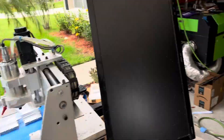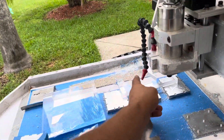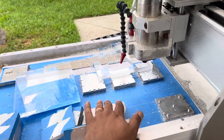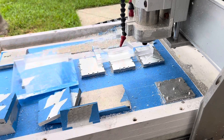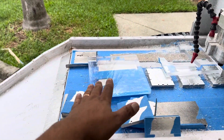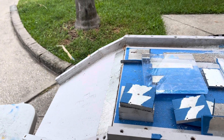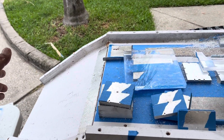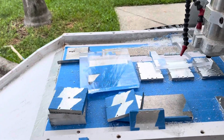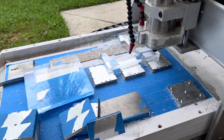It's a mess — everything is a work in progress — but it's working beautifully. The way I have it, water comes out through here and when I'm cutting aluminum it cleans out the area, gets rid of the chips, cools down the piece. The water flows, comes down here, and I usually have a bucket at the bottom that collects maybe 80–90% of the water and aluminum chips, and then I just dump it.